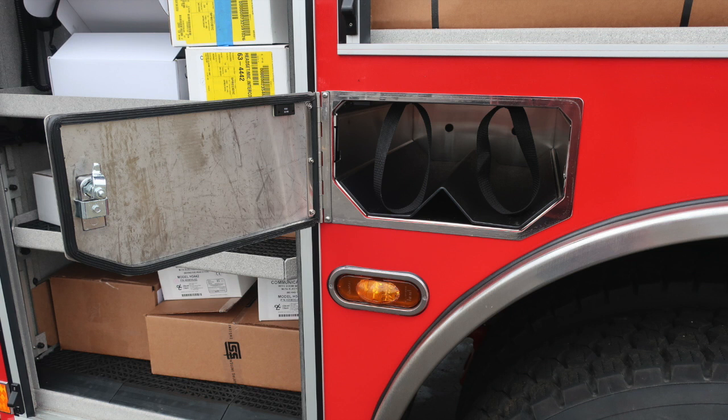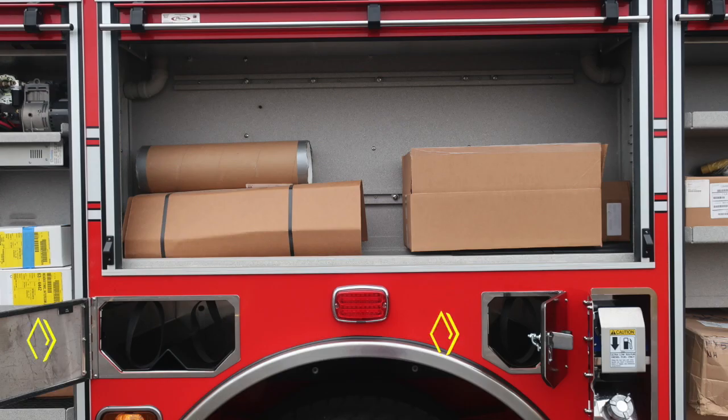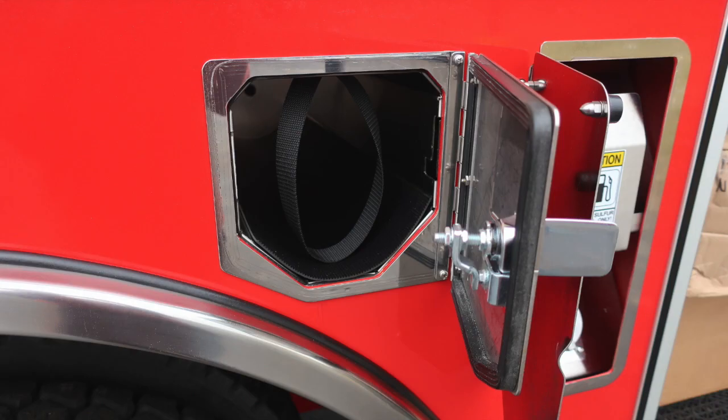As we're back now to the outside or exterior, you'll find SCBA bottle storage with straps. You'll find there are 3 located on the driver's side. As we move further to the back, you'll find your fill location for diesel. It is the silver cap. As you flip the latch downward, it will expose the blue cap, which is your 4.5 US gallon DEF tank.